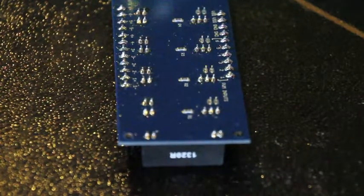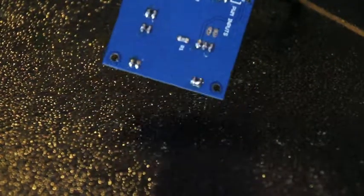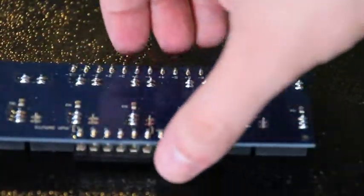I'm just going to check my joints. Let's finish these last two here at the end. This one looks like a cold joint. So here's basically my first mistake on these boards — there's a bridge here. I don't know if you can see, it's not zoomed in the greatest. There's a bridge on that pin. So what I'm going to have to do is take my desoldering vacuum and vacuum that up. But this is where I'm going to end the video.